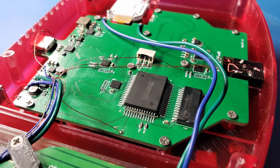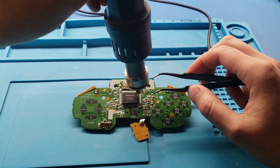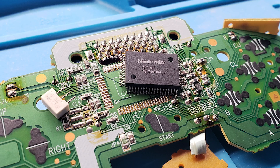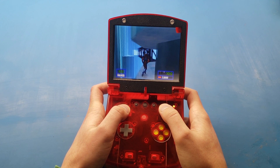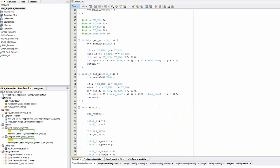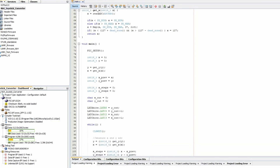Under the hood, it now features a built-in FRAM memory pack for saving games. I used a real N64 controller IC with a microcontroller for converting the 3DS slider to replace the old stick. This was a mini project in itself, which I enjoyed learning how the original N64 joystick works. It's actually an encoder instead of a potentiometer most joysticks use nowadays. The microcontroller gives me the opportunity to include better scaling and range for the joystick and gameplay in the code.